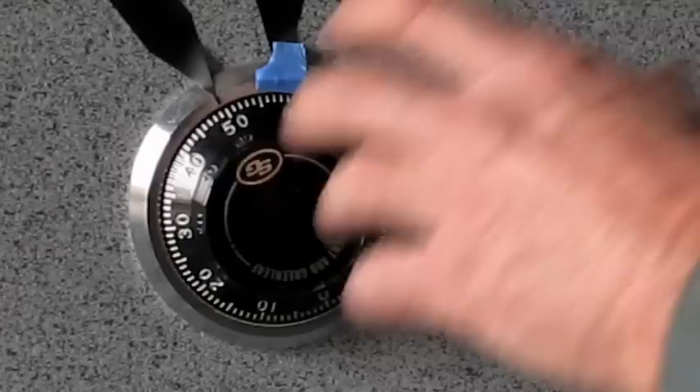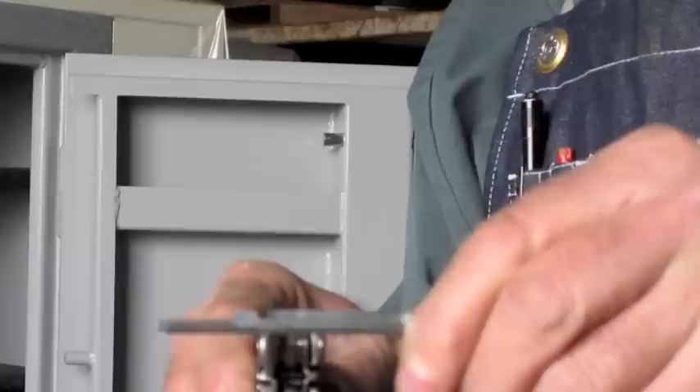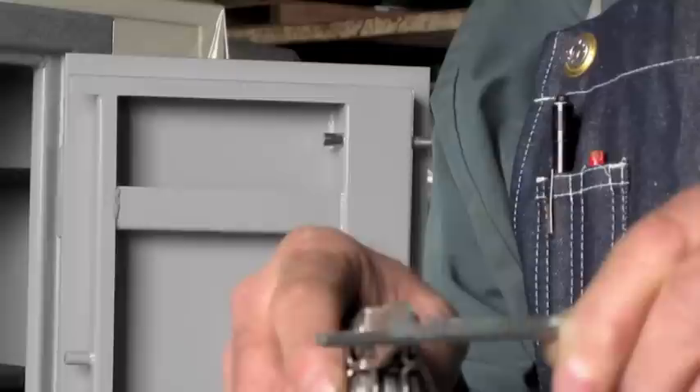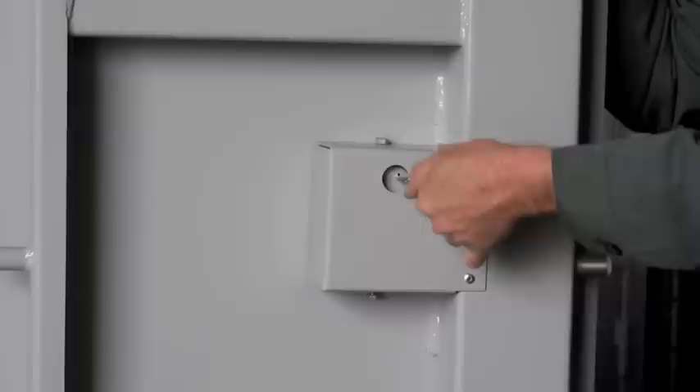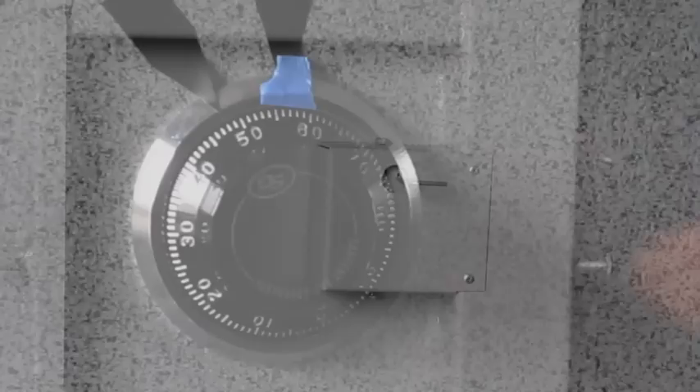Do not turn the dial back for retraction, because we're not trying to open — we are trying to change the combination number. At this point you open the door up. This change key should go into the combination box to where this point right here is almost at the edge of the lid on the combination box itself. In other words, this little notch is just buried into the box. Change key is inserted. Rotate — it has a little click to it. You are now ready to dial in a new set of numbers.